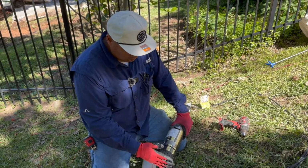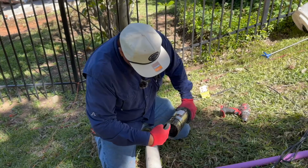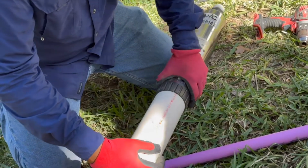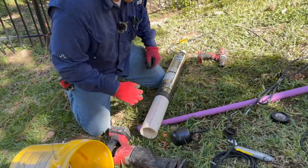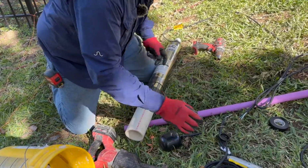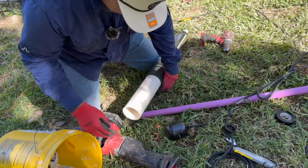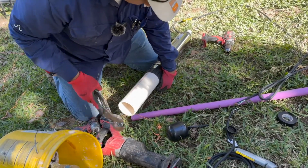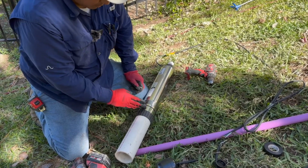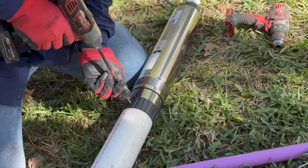With the screen being so low to the bottom, what we like to use is a scrap piece of 3-inch PVC. On these Aider pumps, you can see that there's this stand, and you can fit a 3-inch pipe in there pretty nicely. And so what we do is just use stainless steel screws to affix this guy on there. And it keeps the bottom suction a little higher off the bottom of the tank, in case there's ever some heavy sludge at the bottom.